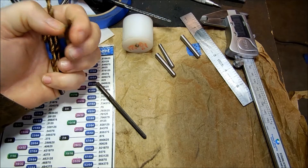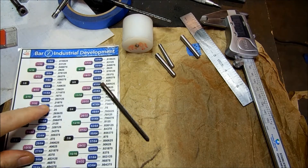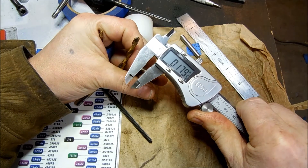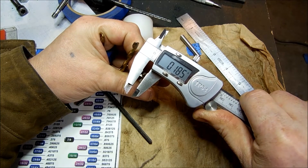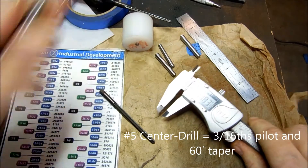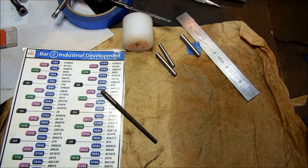What I want to do is take this center drill out to the actual finished diameter of where I want the pin to land — so 218 thousandths. I'm going to find that diameter on the taper. This is a 3/16ths pilot on this, and I'm going to take it just a little bit past — barely graze it and put a chamfer on that hole. Then we're going to go with the drill bits after that. Let's go over to the drill press.